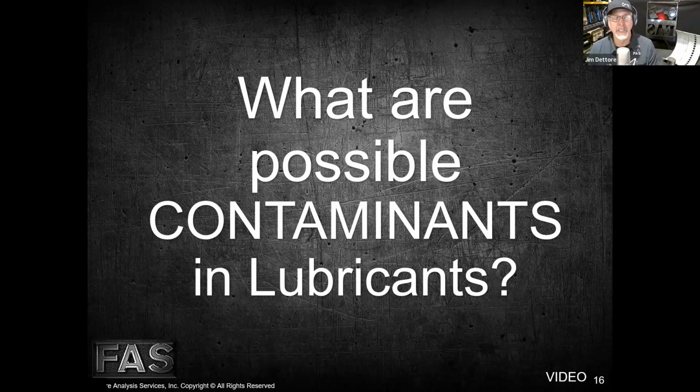The pig mat fibers, oil absorbent mat, the kitty litter. The folks that still use kitty litter in their shops to clean up oil, that stuff becomes airborne. Folks that use kitty litter in their shops, when you're sweeping that up, it becomes airborne immediately. When we walk into a shop, and sometimes there's that guy, and look, if you're that guy, I'm not picking on you, but don't use the air nozzle to blow out your bay, especially when you've got components on the bench, because that big dust cloud that you just created, it's covering everything. So keeping things again as clean as possible.